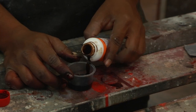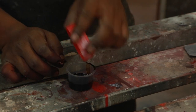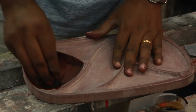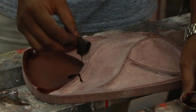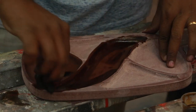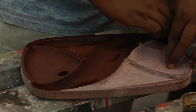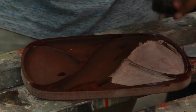For the MDF I used walnut color because I wanted to go for a brown look. Again I thinned it out with the NC thinner. I personally like this finish much better than the rosewood finish — the brown actually makes it feel like it's real wood. The quality of MDF also matters. The MDF that I used is from Century and they give really good output. If you use any other material the fibers in the MDF are different and it does not give a great output. So I stained the MDF pieces also 4-5 times making the color darker.